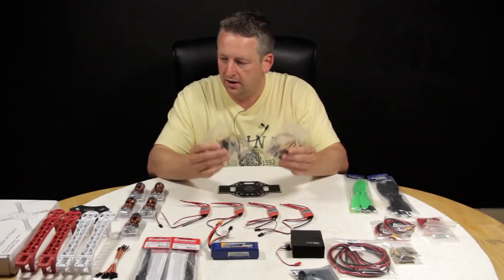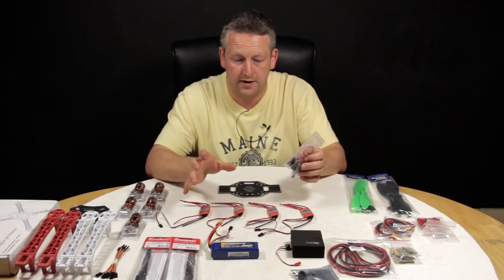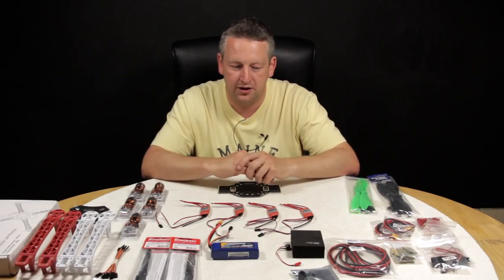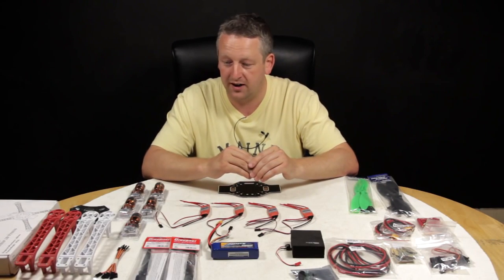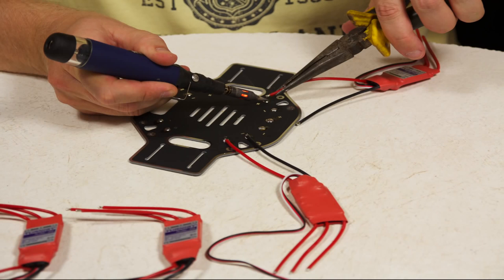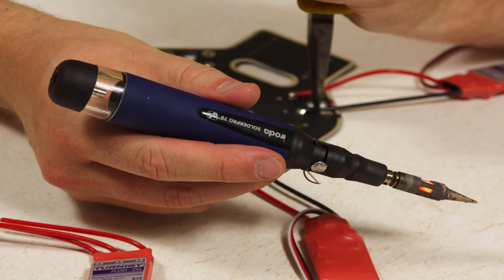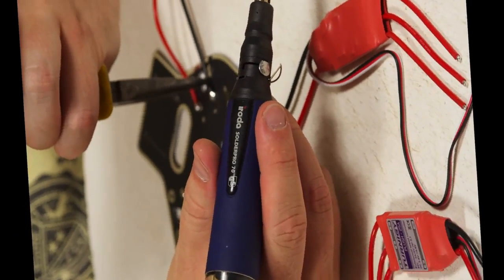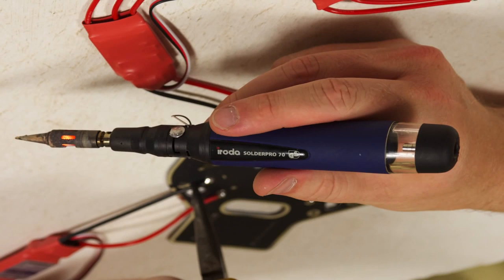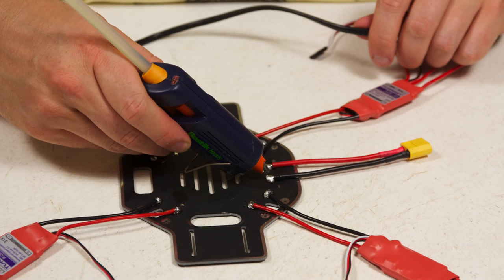After seeing some YouTube videos, there's the ability to put tilt rotors on the back of these, and that's going to be the idea eventually — but this is going to be a build for the standard frame first, documenting all the pitfalls before we look at upgrading. So the first step in this build will be tinning the integrated PCB so that it is ready for the ESC power leads and your choice of battery connector. A good soldering iron is essential — I use the Solder Pro 70, but any iron capable of 70 watts will be fine.